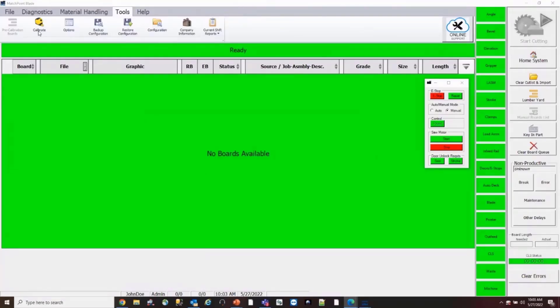There are two different levels of calibration for this saw. The first is just your normal home position, and the second is the admin or counts-per-inch calibration. The home position — if you imagine your axis, say the gripper being 16 feet long — shifts the reference left or right to find where the home sensor is. The counts-per-inch calibration defines how many encoder counts equal one inch of linear movement on that axis. Most of the time you'll just use the home position, unless you replace something mechanical like a servo motor or bearing.